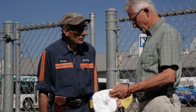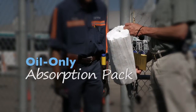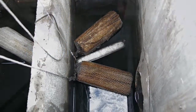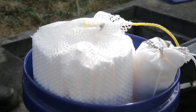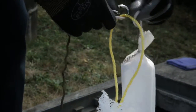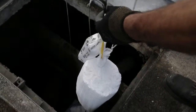Smaller amounts of oil accumulation can be removed using oil-only absorption packs in the inlet chamber. These help collect and remove oil and can be a fixed part of your system. Oil absorption packs are made of a plastic material that floats and repels water but will absorb oil, so they leave the water behind and take the oil out. Part of our preventative maintenance program is to have all the oil water separators with the absorbent packs in them and to check the status and condition of those packs.